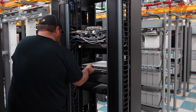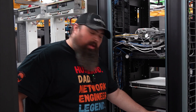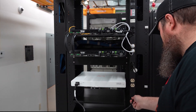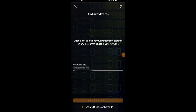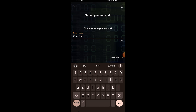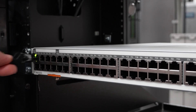I got lucky — there was already a shelf right where I wanted to mount the switch. A tip: don't tighten your screws all the way until you've slid it fully in. Now that it's mounted, connect the power supply. Getting the switch powered up is simple — just plug it in and it powers on automatically. The switch takes a few minutes to boot; you'll see the cloud lights blinking green and orange when it's ready to be added to your profile. Adding it to your account is easy — scan the barcode on the back or manually enter the serial number in the app. Once the switch is claimed and the APs are plugged in, the app auto-discovers all connected APs.